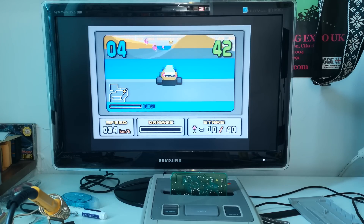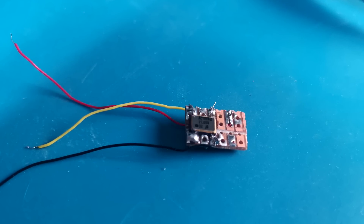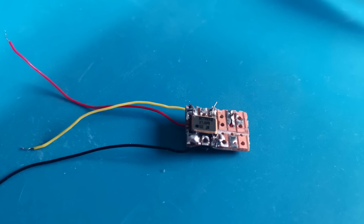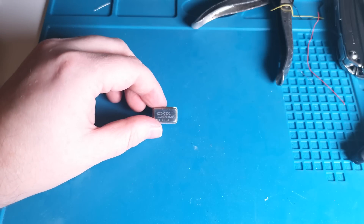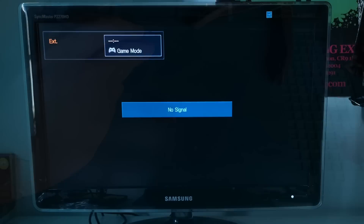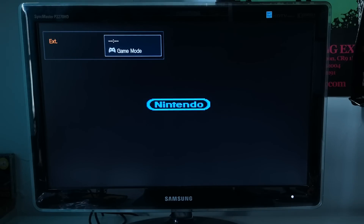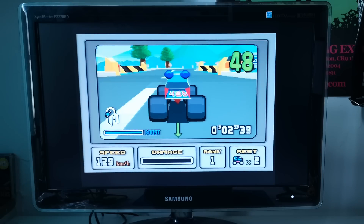All is not lost yet, because the 27 megahertz oscillator I've got isn't quite the right type — I had to bodge it to make it work, which I'll explain later, but maybe that's actually the problem. So instead of going lower, I might as well try to go higher first with a 30 megahertz oscillator, which is the right sort of component. Does this work? Yes, indeed it does. Does it stay working? Well, actually, it does seem to.